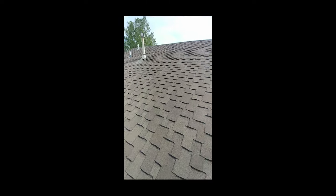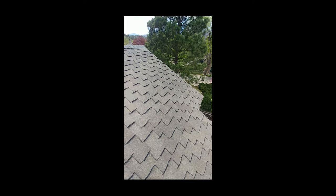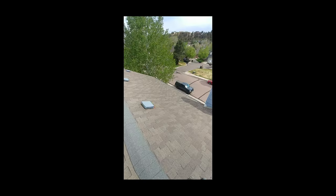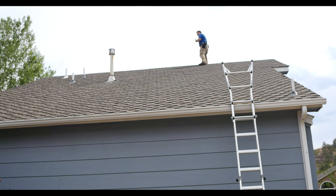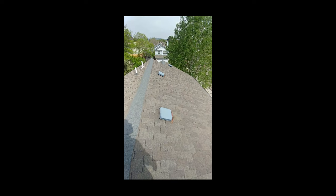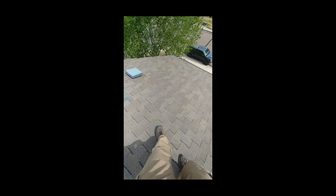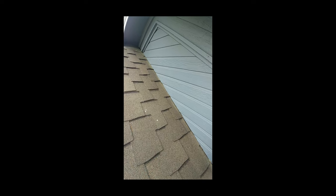Don't walk backwards on a roof — that's a recipe for disaster. I wouldn't move too far over on two stories because that can be a very bad day if you trip or something startles you. Pay attention while you're up on a roof and look for some temporary fixes. I kind of work in a circle that way you don't miss anything. On very complicated roofs it's easy to miss things, so make sure you stay with your game plan.